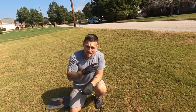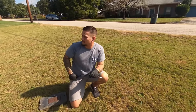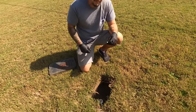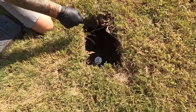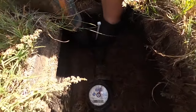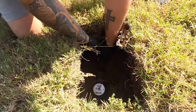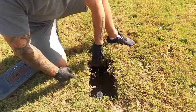We've got helicopters everywhere. We're down here in Enterprise, Alabama, not too far from Fort Rucker — they're obviously doing some training. Shout out to the United States Army and all the people who serve. I'm at the water meter. The very first thing you're going to want to do before you start this winterization is come locate the water meter, make sure your water's turned off, put your zip tie through here, and take a photo of it. Over the years doing this, this is one of the most overlooked steps in the entire winterization process, so I always knock it out first thing before I get distracted.